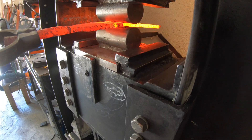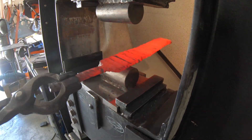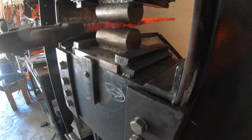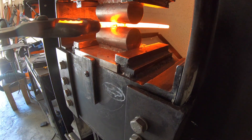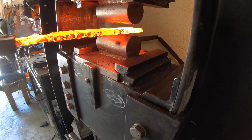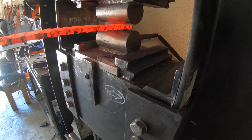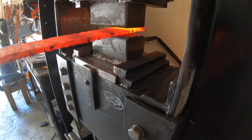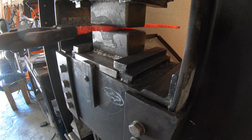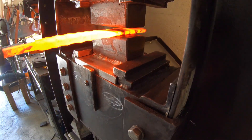This is a really important step using these aggressive round dies. This gives you that wavy pattern down your blade and you don't just get a straight line, so it's really important to use these on San Mais. I've learned over trial and error that definitely the way to do San Mai is to weld up all of the seams. Don't let any air inside it and you're good, especially on the stainless San Mai.